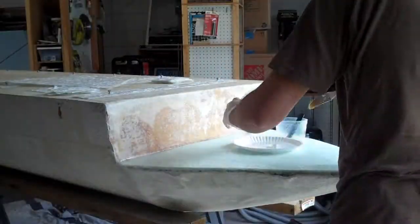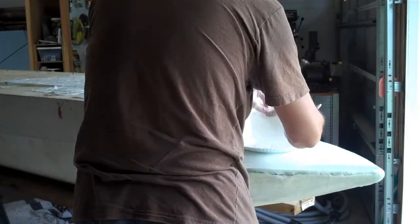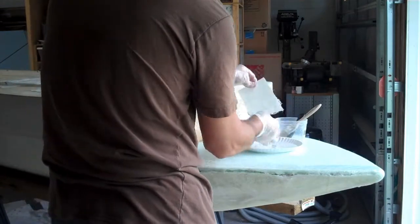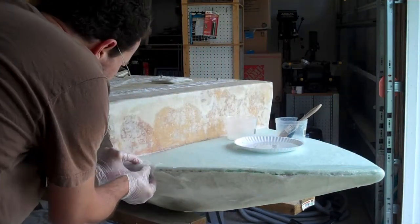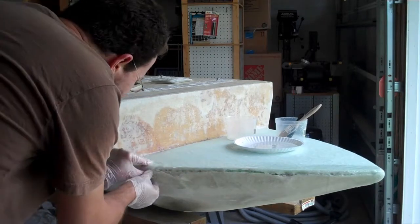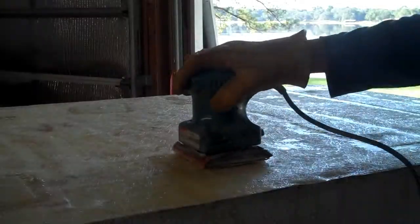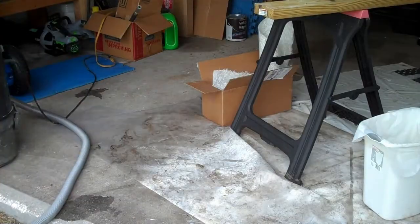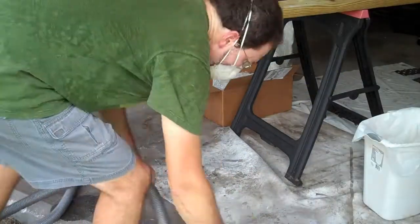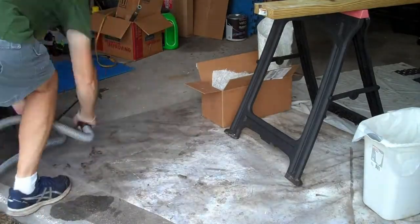When joining the top and bottom pieces on the nose cone, I cut small pieces of chopped strand mat soaked in resin and rolled them around the edge, then used a chip brush to dapple the edges down. In a project like this there's a lot of sanding involved — I sand each layer and vacuum up the dust afterward. You definitely want to have a P100 respirator when working around fiberglass dust.